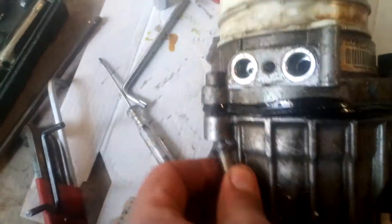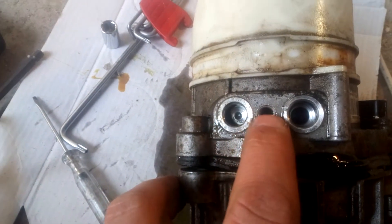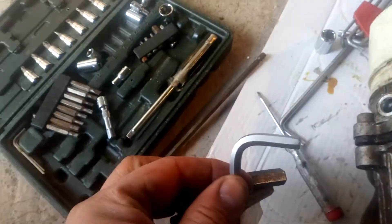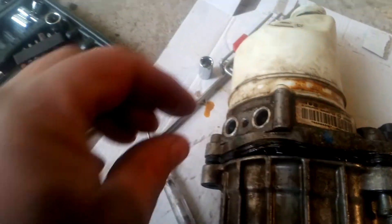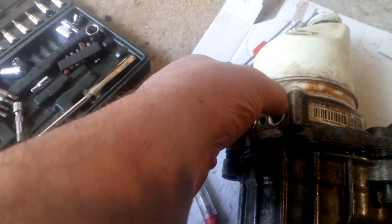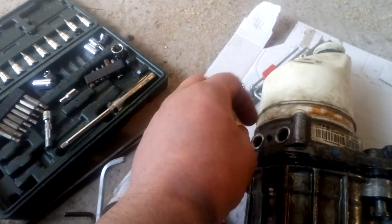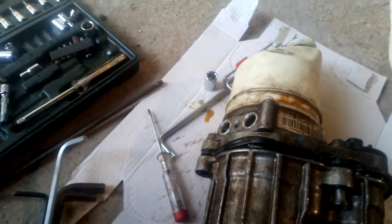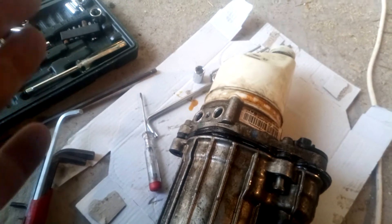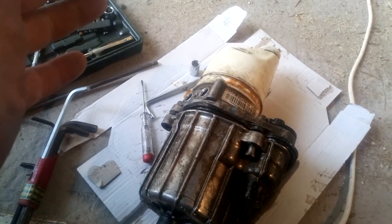This is what the pump looks like when you take out the hydraulic pipes. They're held in with one hexagonal nut — use a 6mm allen key to undo it. One pipe is connected to the mounting plate; the other has a flange and is pushed in by the mounting plate. You undo that and they both pull out. In theory you must replace the o-rings on the pipes, though I haven't done so and haven't had problems — just be very careful with them and keep them covered.